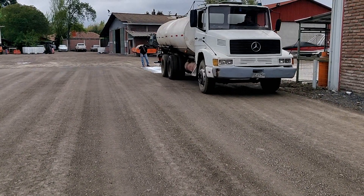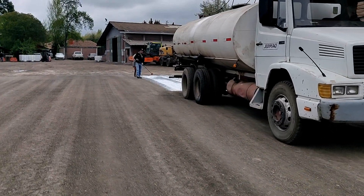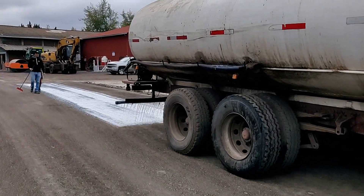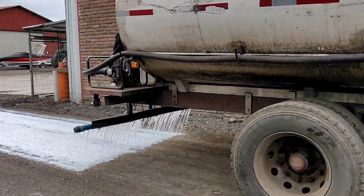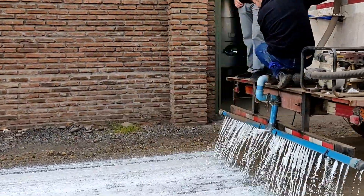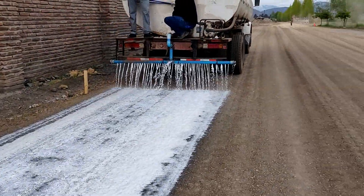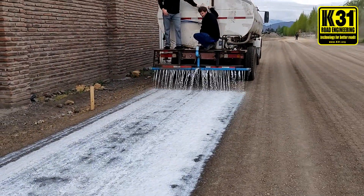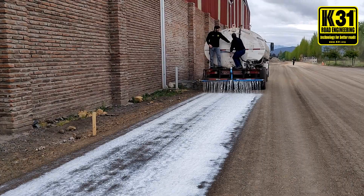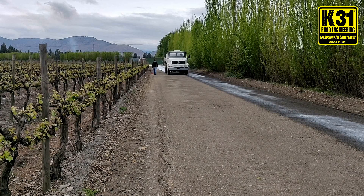This here is already the following day. The road has dried and now we're starting to do what is a seal coat. What this is going to do is act as a running surface protecting the road base that you just finished stabilizing the day before. If you notice, when the truck first started spraying the day before, all the APS was being sucked in — now most of it is staying on the surface. This is only the first coat; you're going to be doing three coats, using a total of half a liter of APS concentrate per square meter of road when sealing.